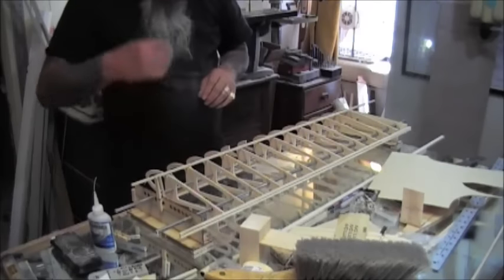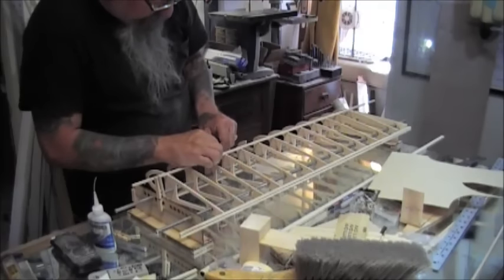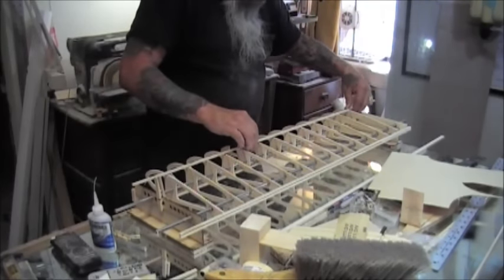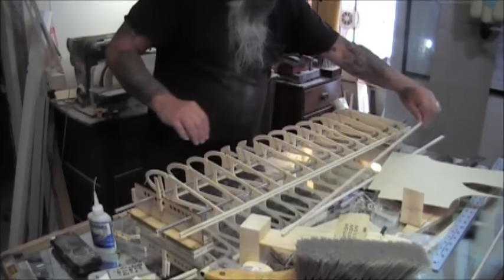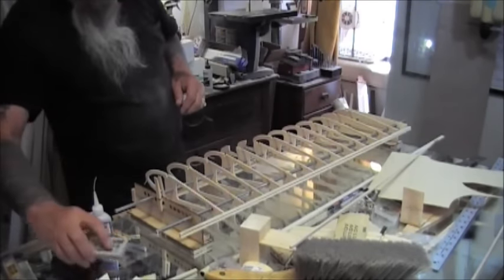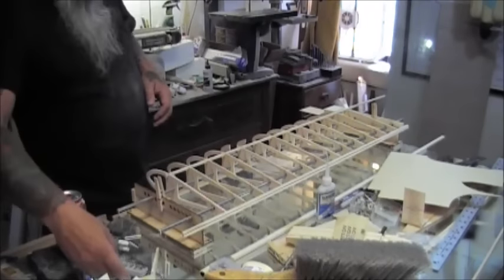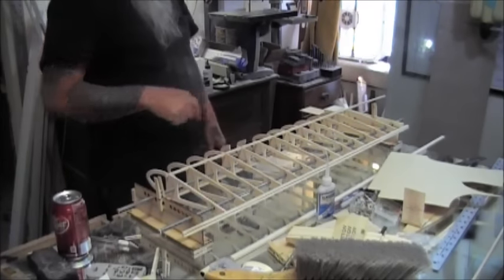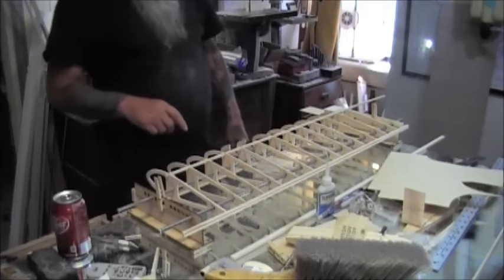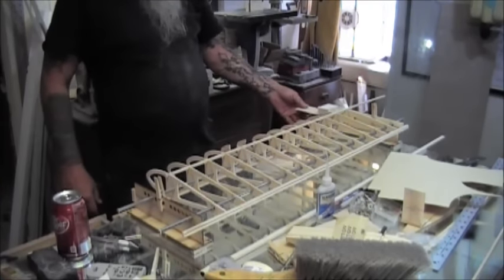I see what that is. I have a problem on the rib that I put plywood on. So, I'm going to have to adjust that. I didn't quite get it cut off, so give me a minute. I'll cut this up and we'll get this installed. Okay, what had happened was I didn't notch the plywood good enough to be relieved for the spar.